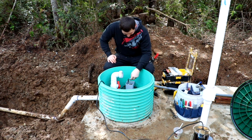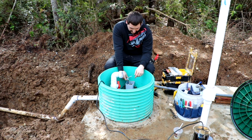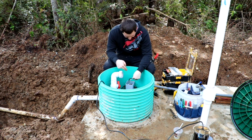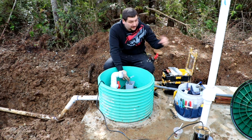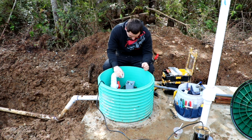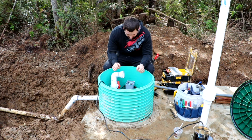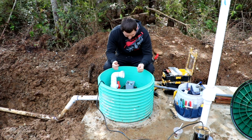I finally got the last connections done. These are those watertight wire nuts — they're full of gel, it's really goopy. Anyway, I groomed everything else down in the box. I'm going to groom this float down in here, put the lid back on, and this will be ready for inspection. I'm going to go ahead and put the pump back in the tank and test this all before I put the lid back on to make sure I didn't inadvertently get one of the wires not quite contacting right.